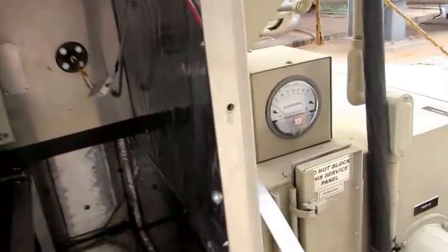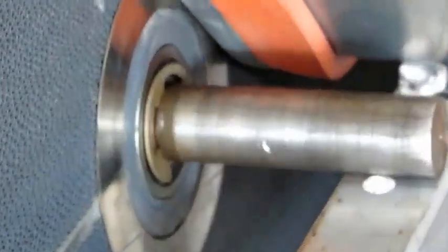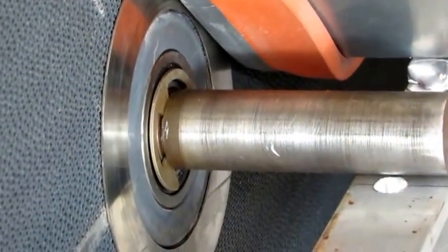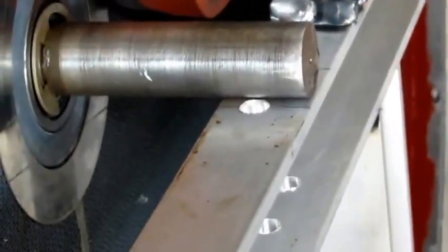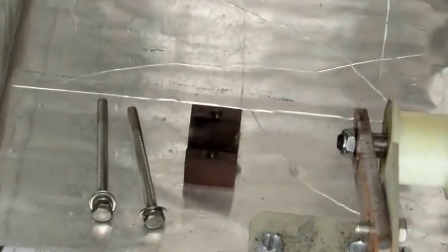And I'm a believer that guys that design cars and machine tools and equipment should have to go out and maintain and work on what they design. That C-clip right there should have probably about a 1/16 of an inch end clearance, so you don't have to fight it so hard. But anyway, we got it in position where we're going to put these bearing blocks on each side, and that's the next step. Put that back together with the bolts right there.